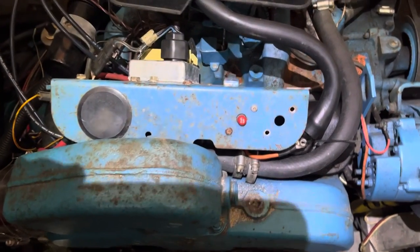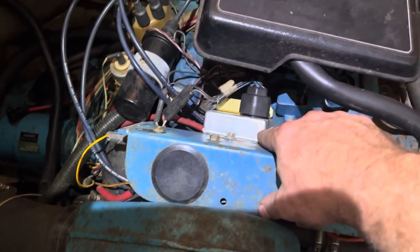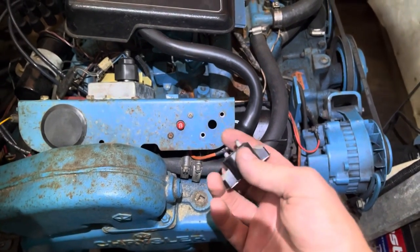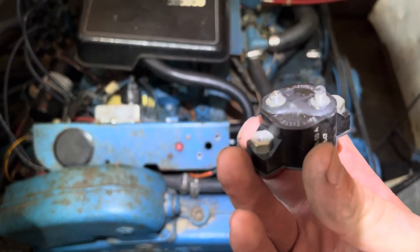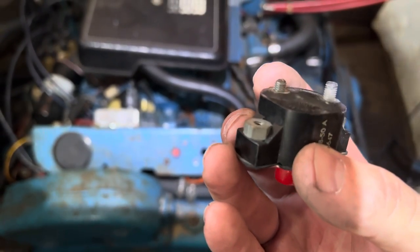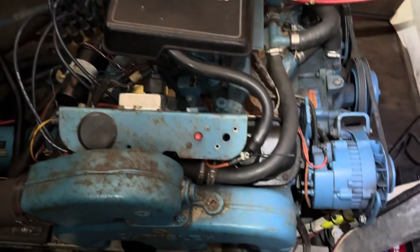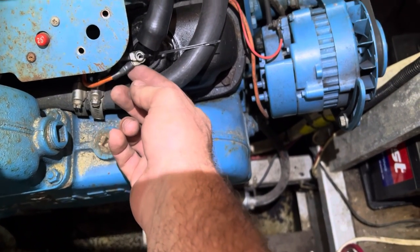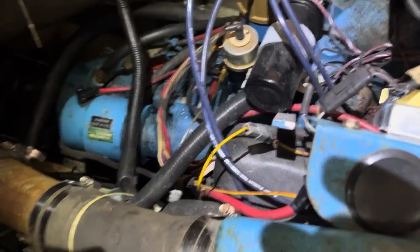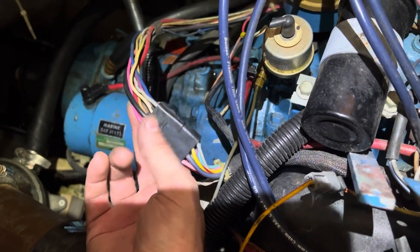Down in your engine room, this is going to be your breakers — one sits here and one here. Then this is where your electronic ignition box is, and you've got your starter solenoid underneath here. First thing I thought was I'd check the connection on here, and one was loose. Then I just barely touched it and it broke off — it was just corroded in two. I didn't even turn it hard, it just fell right off. I thought that was my problem — nope. I zip-tied the wire together and checked the wire loom over here.